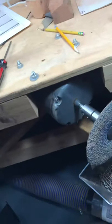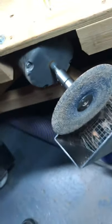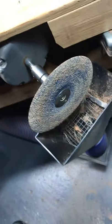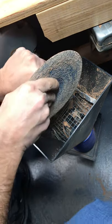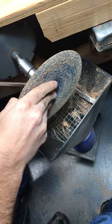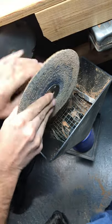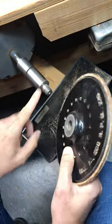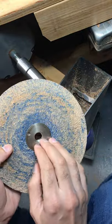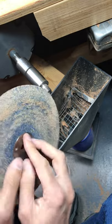Here I'm going to take this apart so you can see what it is. This disc's backing pad you can get at Harbor Freight. This is a kind of direct mount onto this custom arbor, and the problem with this is it's hard to get the disc straight on here, and there's going to be a little bit of a bend.